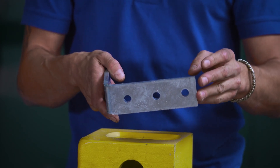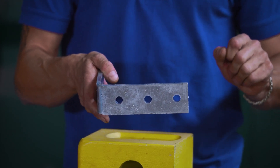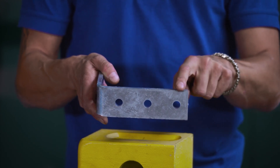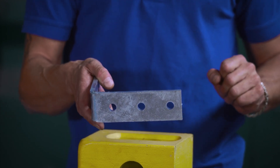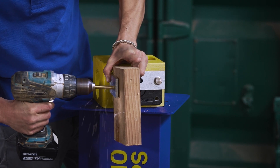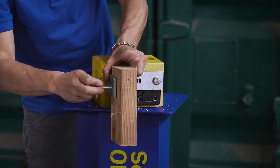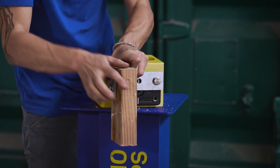The other side, 160 millimeters long, is what sets this apart from our other brackets. It has three holes, which means you can attach this horizontally to the domino clamps, allowing you to then bolt a vertical timber to it. It is especially suited for four inch and six inch timbers, giving you plenty of meat on the timber to get a couple of bolts right through.